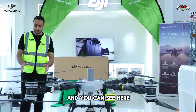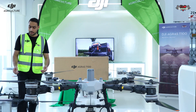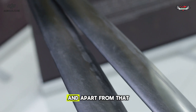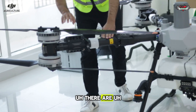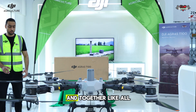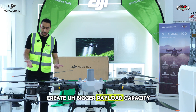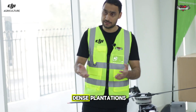You can see here we have huge coaxial dual motors that come with massive 62-inch carbon fiber propellers. Apart from that, there are huge ESCs, and together all this equipment will help you to create a bigger payload capacity and bigger downwash for better penetration in dense plantations.